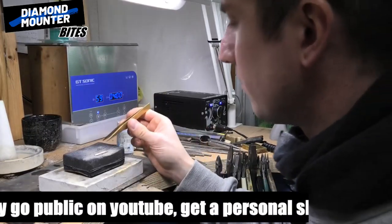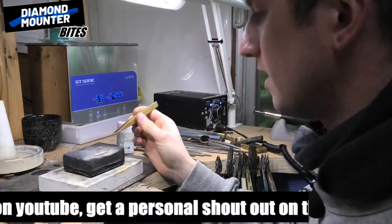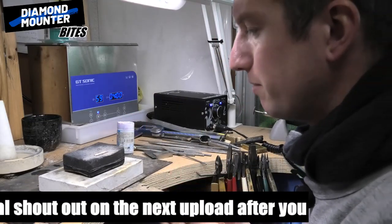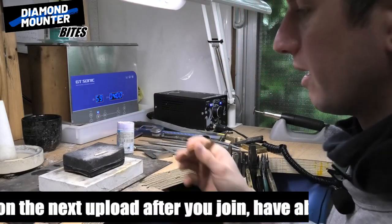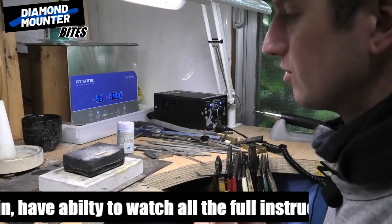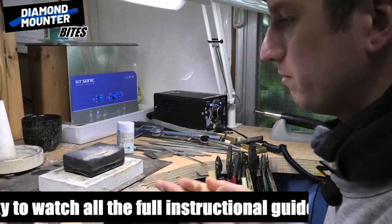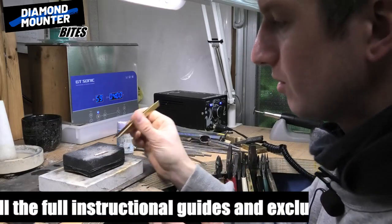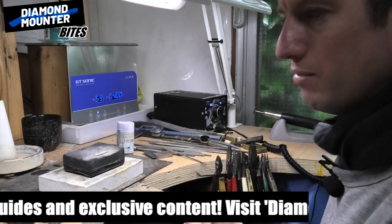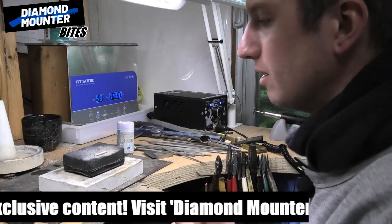While that's cooling down, the reason why I did that at this stage is because next we're going to be folding it up ready for soldering down the middle. Where we've been bending it with pliers and I just hammered it, the metal is work hardened so it's quite brittle. If I try and fold it up without annealing it there's a chance — not definitely going to happen — but there's a chance it's going to crack or even worse split down the center, and that's a problem.